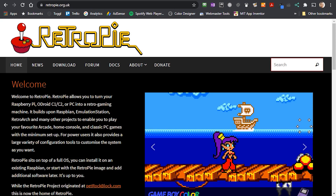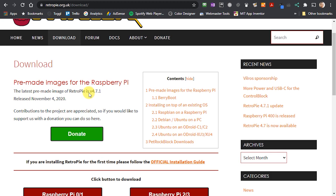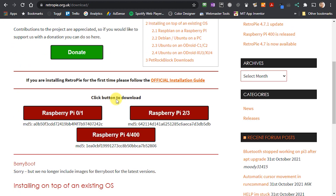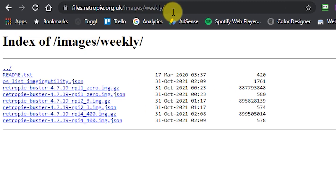One of the first issues you'll need to overcome — and this is only because the board is currently very new, having only been released a couple of days ago — is that the official RetroPie release for the Pi Zero is not compatible with the new Pi Zero 2. However, since the new board shares the same processor cores as the Pi 3B+, builds for that system should give better compatibility. The new Pi Zero 2 does use a different Wi-Fi chip to the 3B+, so we need to use one of the very latest weekly builds of RetroPie rather than the official stable release, as these include the newer kernel with the correct driver software. You'll find these in the RetroPie weekly builds section — I'll put a link in the description below.